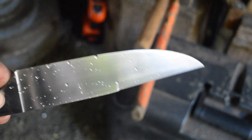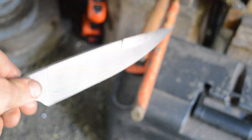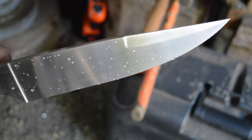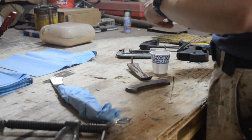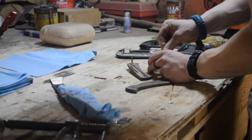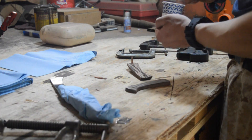I got it all polished to 600 grit. It's a little bit thinner than what I like, especially for a bowie knife, but I'm really liking it — it's got a nice polish to it. After hand sanding and getting it all nice and cleaned up, I'm going to add these black walnut handle scales to it.